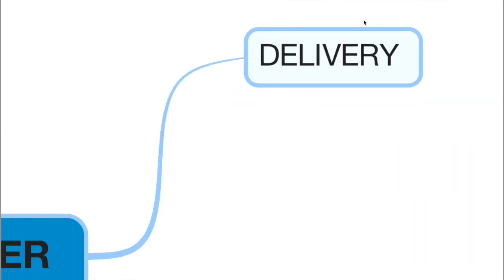Let me explain in detail. We obviously need to make sure that we have delivery of water to our house, which happens by two ways. Either you have a big tower — which is quite ugly in the city — and a 10-meter tower can give you one bar of pressure, which is not a lot. Generally what comes out of your taps is about two to three bar, so having a 30-meter tower is just not acceptable. The other way is having a small pressure pump, as you've seen in the previous video — as soon as you open a tap, the pump kicks in and gives you pressurized water to your house. You can disconnect with a special valve, basically disconnecting from the municipality grid, and then turn another valve to allow this pump water to be plumbed into the house.